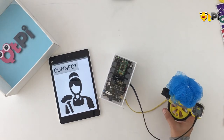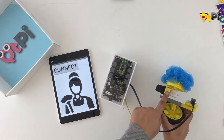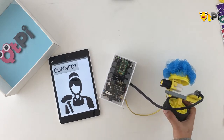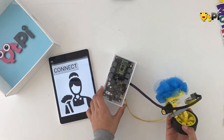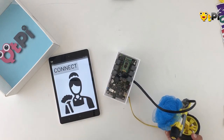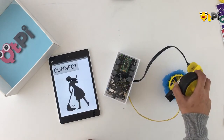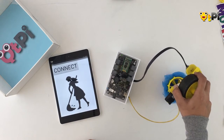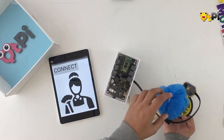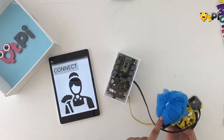Here's what my scrubber looks like. I've attached a wheel and put my scrubber on it, connected to my DC motor. I have my IR sensor, and I've also put a wheel at the back to help grip it better. I've connected all this to my motherboard. Here's the app that we built — I've already connected the app to my motherboard. Every time I face it towards the surface, the IR sensor detects the surface and the motor is switched on.